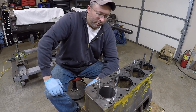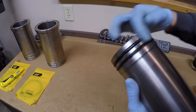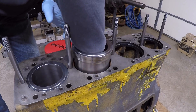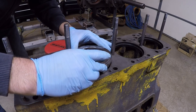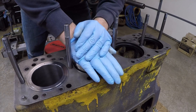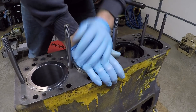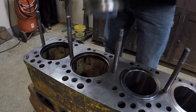If you hurt a seal, it's an amazing amount of disassembly to get back in and reseal those liners. So either I'm lucky, or this little girl just wants to live again. Long story short, I repeat the same process an additional three times. Liner number two is ready — let's see if I can get lucky a second time, starting only with hand pressure. Line it up at the bottom, make sure the black dot is in proper position.